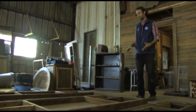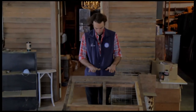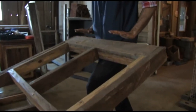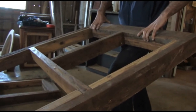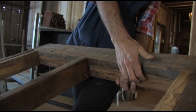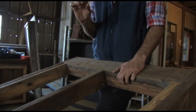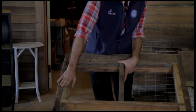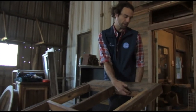These effectively form the structure that's going to support the wall around the window. We have the header up top which allows the frame to span and allows load weight from up top to come down. This is very strong - it's actually two 2x6s put together with two pieces of quarter inch spacer, because two-by material is always one and a half inches thick. When you put two together you only get three inches, but a 2x4 is three and a half inches, so you need a little spacer.